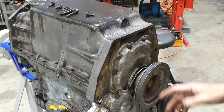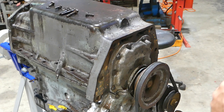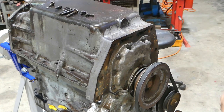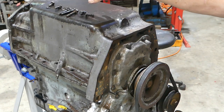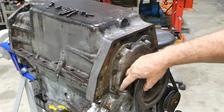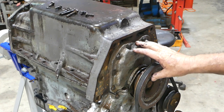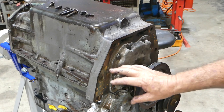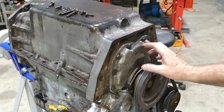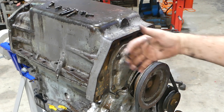You'll undo that anyway doing an engine rebuild, but if you look down inside here you can see where there'll be a little cork in there. I've still got to undo the bolt on the other side, so we'll just run that off. The back you don't need to do anything with — you do need to get these two front bolts. If you hadn't done everything else and tried to get the sump off and left these in, you can just imagine how these little lugs would just love to break off on you. If you've got the front axle pivot forward enough out of the way, you have to have it away enough to clear this — it's not a straight run down. The best idea is just to pull the whole front right out of the way.